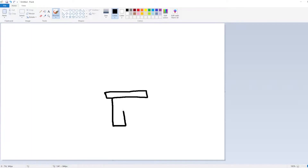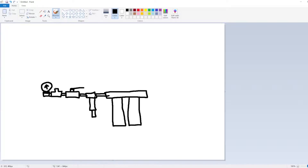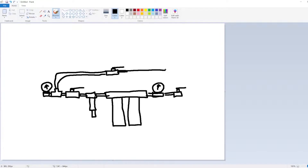One of the first items on the agenda is drawing a diagram of what we're going to build. The purpose of this is simple — it allows us to visualize what we're going to build prior to building it, and also to create an inventory or bill of materials of the pipe fittings we'll need before we venture out to the store. We've got a ball valve, a tee fitting, a pressure gauge, and a bypass loop with a valve — this is vital so that we can service the whole house filter without shutting water off to the whole house.